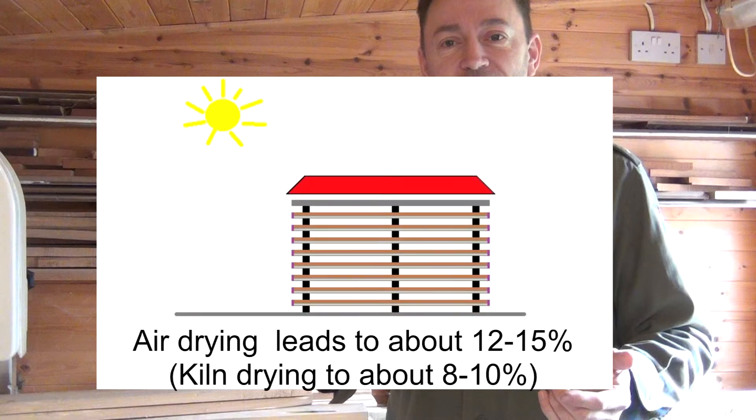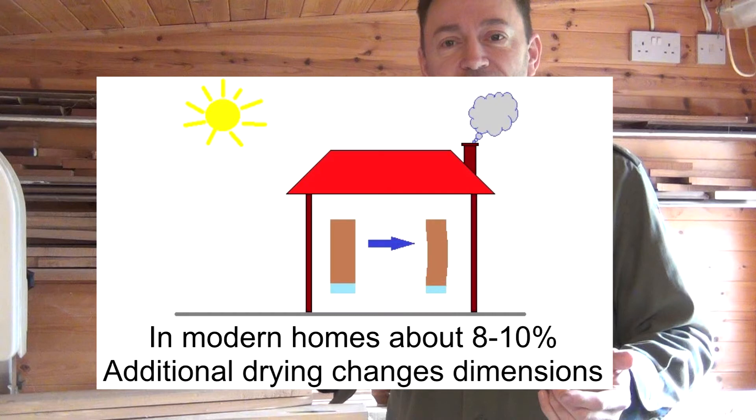Processing wood, we stack it and air dry it or kiln dry it, which will remove a lot more of the water — perhaps bring it down to somewhere between 10 and 15 percent. In a modern home wood balances out at about 8 to 10 percent moisture content. As wood dries out it shrinks both in its width and its thickness and it also tends to warp a bit.